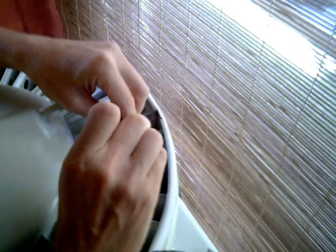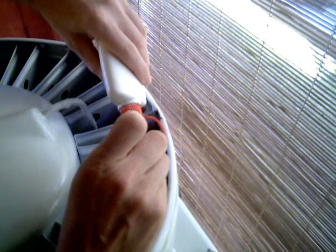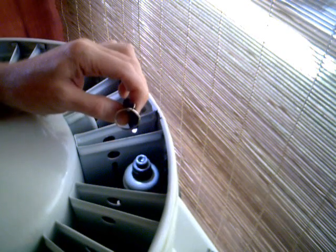Next I'll tighten up the screw just a little bit more and start it up. Put some oil in. When the condenser is running above atmospheric pressure we should not see any bubbles there, and when it's running below atmospheric pressure the oil should not be sucked in. So the next thing to do is to see how the frost line changes and whether we get an improvement in the running cycle. There you go — that's how easy it is to add methyl formate to a CA2 monitor top.